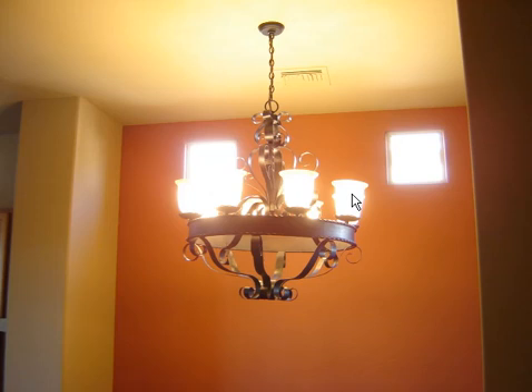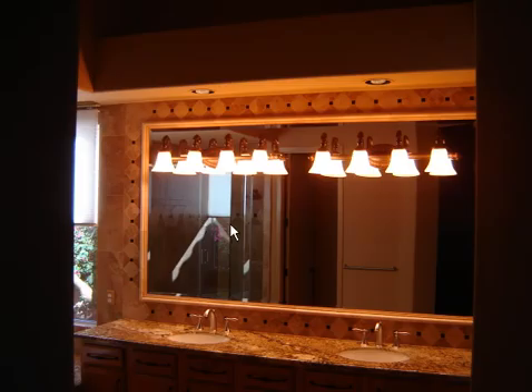And then, of course, the bathroom — we had a problem there too. There are eight of those on the original 100-watt light bulbs. You could actually hear them ringing, especially against that glass mirror. It was unbelievable. So we changed them all out to the 60-watt, 130-volt and eliminated the problem.